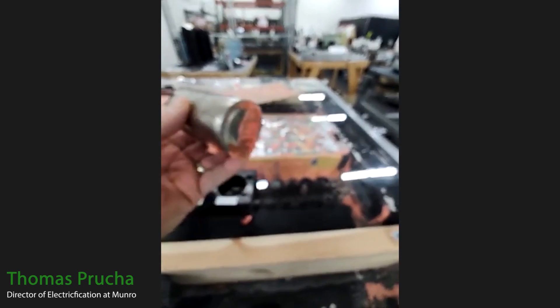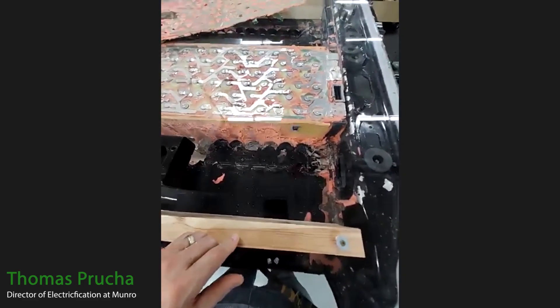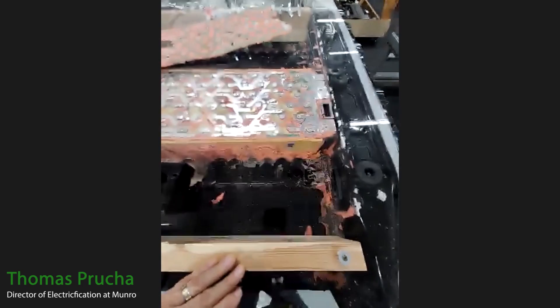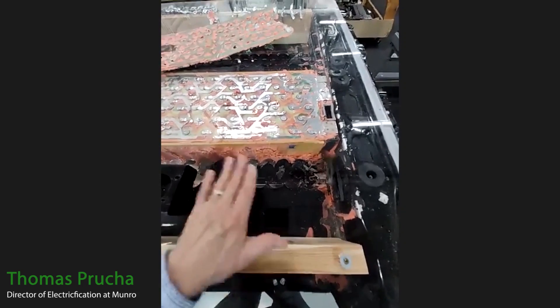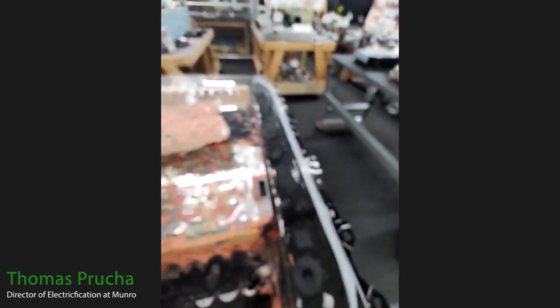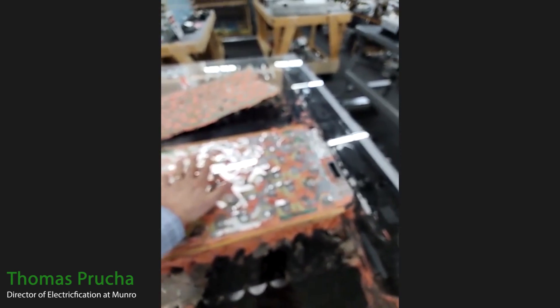The 4680 cell — the structural foam was actually underneath it. That is the polyurethane material. And if you look down in the trough where the batteries themselves sit, you can see that there's mica that the cell sits on, and then there's the little plastic trough that is the vent trough to carry the gases away. So the point is that that's all very soft and compressible. And then if you look at the substrate that sits up on top, it has a lot of compressible materials on it as well, so none of that seems logical to be a place where you would put stresses in the downward direction on the pack.